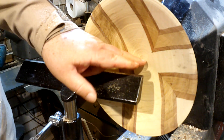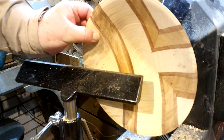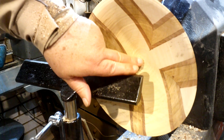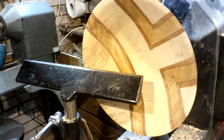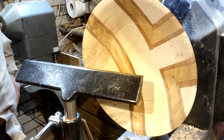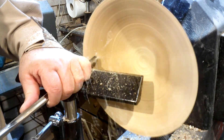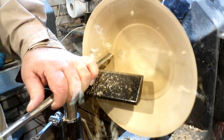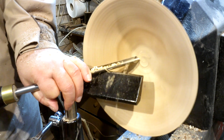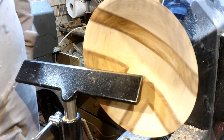So that needs to be 50mm deep, which is pretty much what it is now. I've got quite a nice even wall thickness down there and a nice transition to the bottom. I've got some tool marks in there so I'm just going to go and sharpen my chisel and then come back and give that a nice clean-up cut through there, then I'll sand that up.